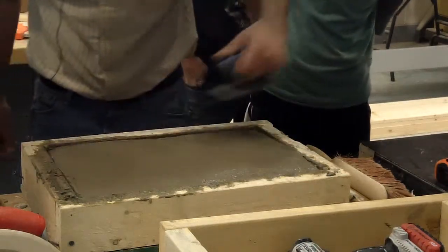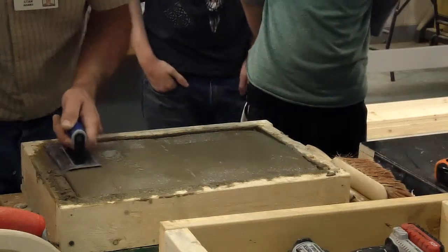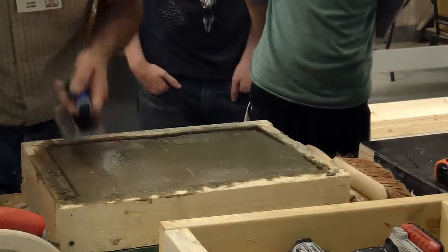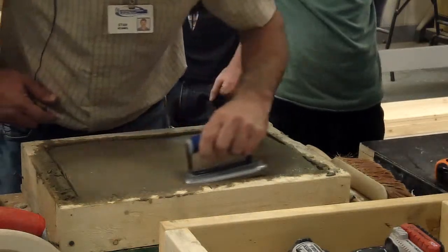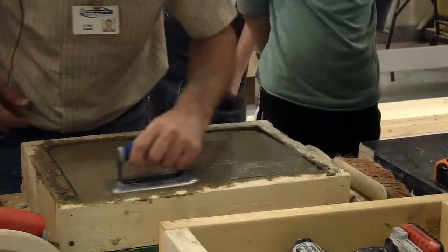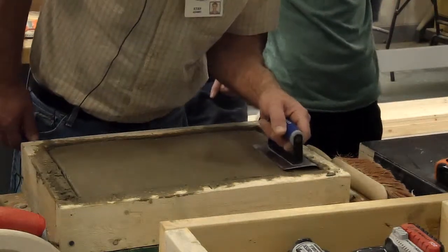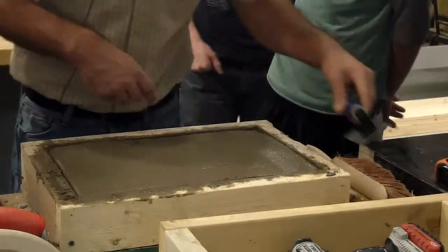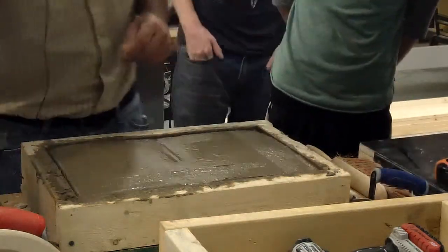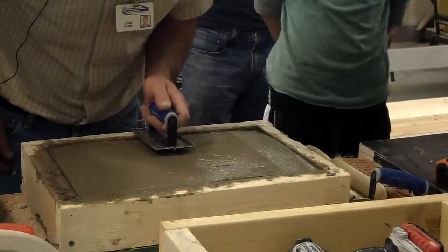Hitting that edge. Remember, you don't want to roll that, so you're twisting your concrete and rolling it down on them corners, or edges rather. I got it rolled. No, went right back to that edge. Okay, and it's leaving that lip, but you'll have to hit that again. Next time we can be a little more picky with it. So then you're going to hit your joint again.